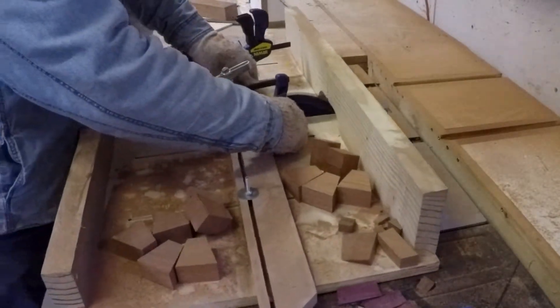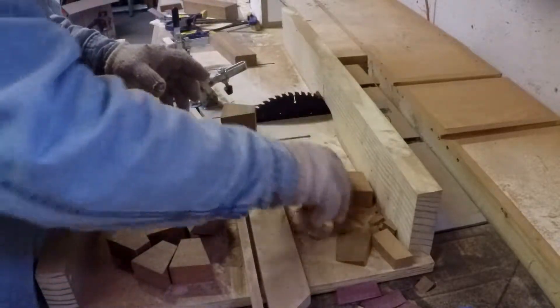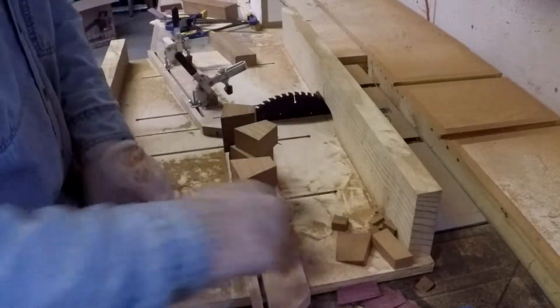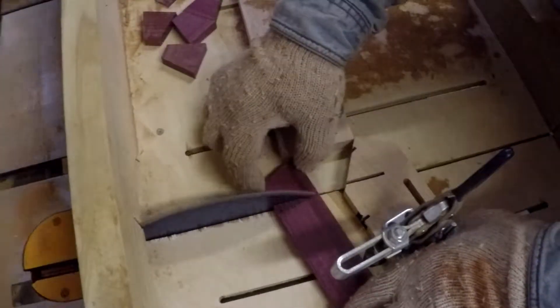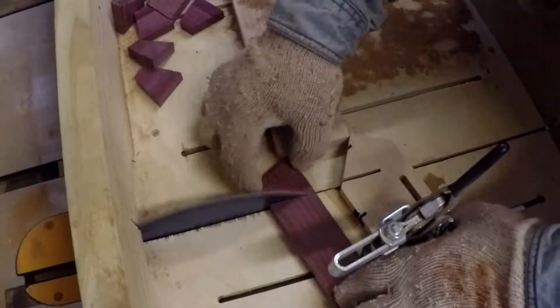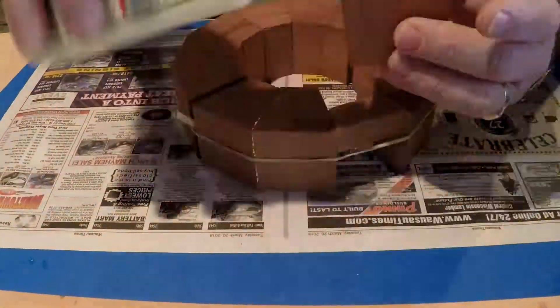In all I made 145 different pieces for this vessel. It's a time consuming process and care should be taken to ensure the angles are as close to perfect as possible. I'm using an adjustable speed square I found at the local hardware store. The difficult part is making sure you have the correct angle — you can miss a little on the length and the width, but missing the angle makes things more difficult. For this reason I always use a number of segments that allows me to assemble them in two halves. I can sand them parallel to each other for a seamless fit if I don't get the angle perfect.